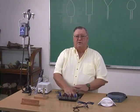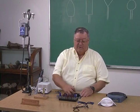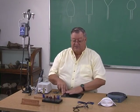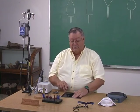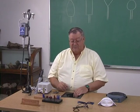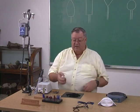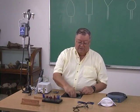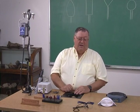Of most importance is a dust collector. Some way to contain and get rid of dust. This I built into the tabletop. Let me move this slightly. And this is nothing more than a motor pan that you can get at any store that supplies dust collectors and accessories. And rather than have a blast gate, which usually goes underneath, I wanted something that was simple, so I have a racket ball to stop the air. And you'll see how this functions later on.